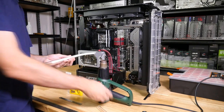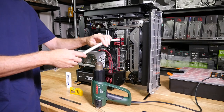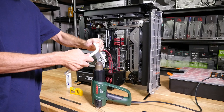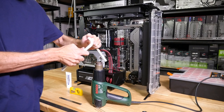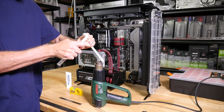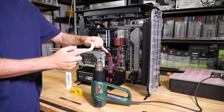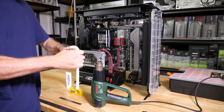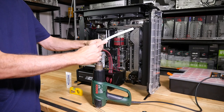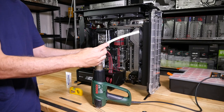That gives me my marker for where I need to bend. Something I should have mentioned is that at no point in time should the tube be still above the heat. When you're doing offsets or complex bends that aren't just a 90-degree bend, you may actually want to heat a little bit more length of the tube. The width of heat from the heat gun is enough for a 90-degree bend if you just hold the tube still, but for an offset you need to heat up a little bit more. Make sure you look at the tube from all angles — you have 90 degrees here and 90 degrees here. And don't assume that it's cooled down enough not to bend, because you can let it go, walk away, and then it slightly bends out again and gets out of shape.